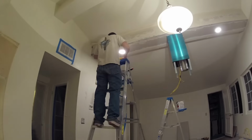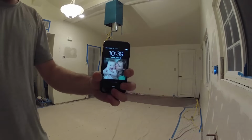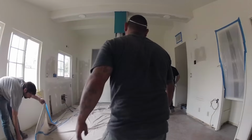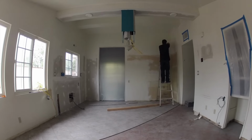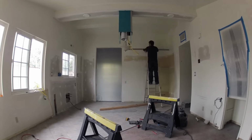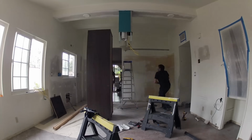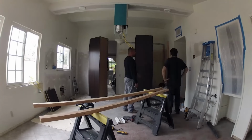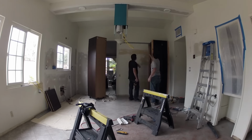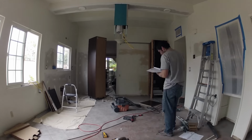So here we are, just continuing on that project. The drywalling is my least favorite part of remodeling. I've done a couple bathrooms in the past, and it's pretty much the dirtiest part of doing remodeling. It creates this super fine, really disgusting sheetrock dust that is horrible for your lungs, and you definitely want to have a good respirator for doing drywall sanding. I actually got this vacuum attachment too for my vacuum that helps suck up some of the sheetrock dust.